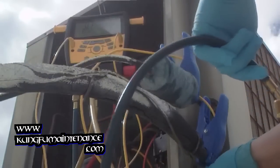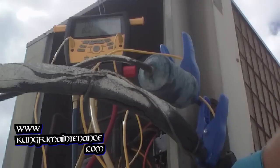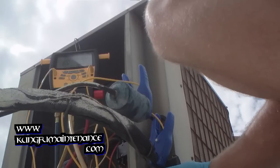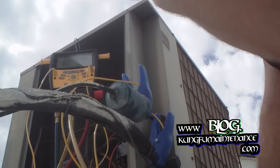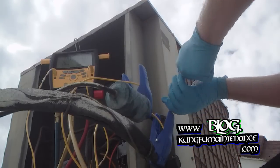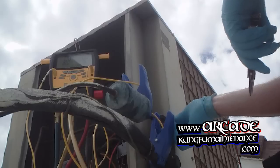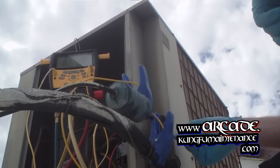Now I'm going to hook up our gauges, pull these. And this one wasn't very low on Freon, it was just a tiny bit low. It actually seemed not like it has a leak, but more like it had a mischarge. Someone didn't charge it enough. So everything feels okay there. The high side. Everything feels okay there, and we've got our O-rings and our caps, and that's good.